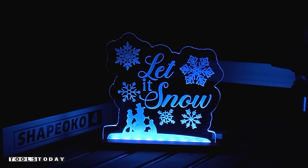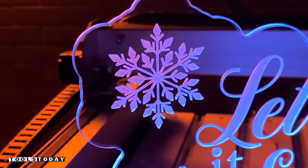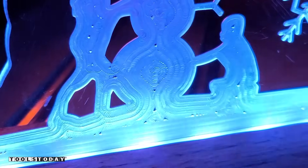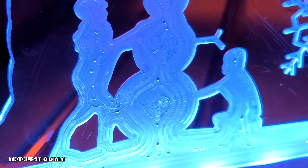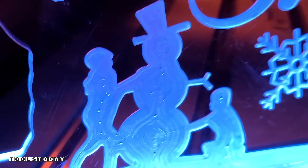This is my first time doing a sign like this, and there's definitely some mistakes on it. I tried to save some time by using a larger step over on the bits — I used 40%, but I should have used about 10%, because you can see some of the lines here. I'll definitely remember that going forward, and I have adjusted the plans so that you won't have that issue. But overall, I really love the way that it looks and I'm super happy with it — and Katie absolutely loves it, so that's really what matters.